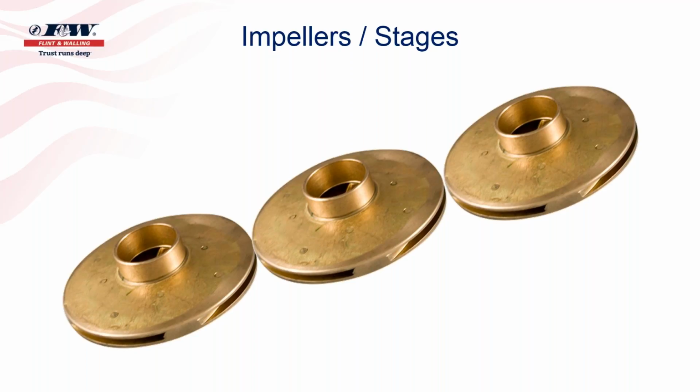So if you're in other parts of the country, like western North Carolina or Chattanooga, Tennessee, or out west somewhere where you've got elevation and terrain to contend with, those are the areas where we will typically sell more of the multi-stage centrifugals, because if a pump has to pump water up 150 or 200 feet above where it's located, it needs the impellers to create the pressure to get the water up the hill. So I guess just in a condensed fashion, many multi-stage pumps are sold where elevation has to be overcome.